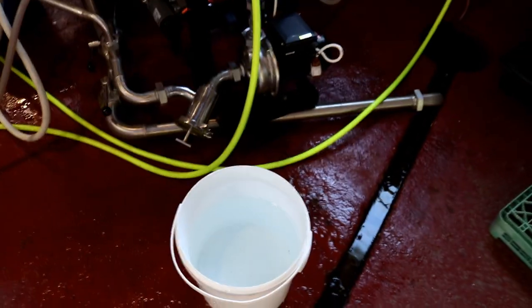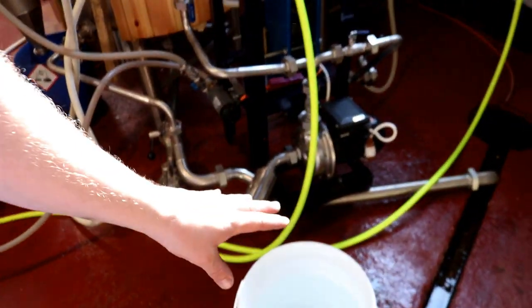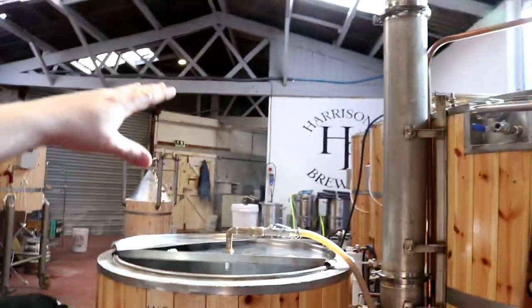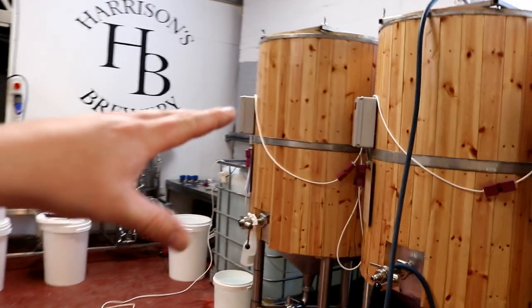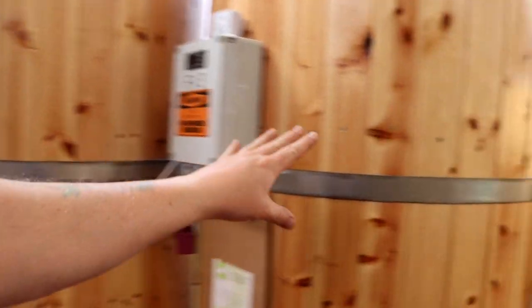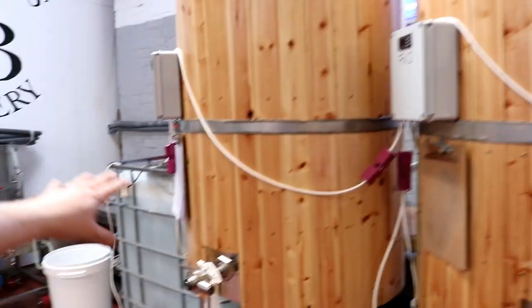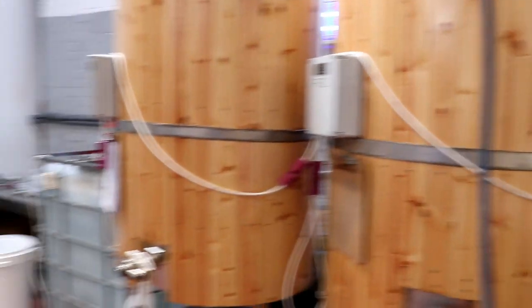Here is the acid I've retained from this morning's plate heat exchanger sanitation — we'll use that to go into the boil kettle to clean it out later on. Just made me think I need to put some water in the HLT. The caustic that's in the fermenter is going to go into FV3 to clean that one, then we'll rinse this with cold water out of the IBC and sanitise it.